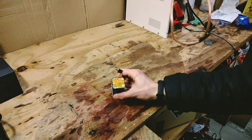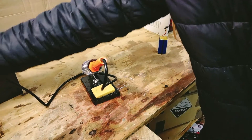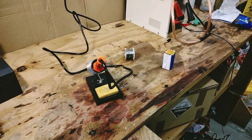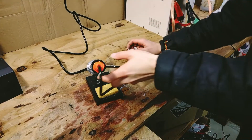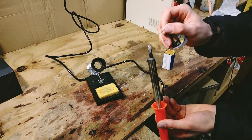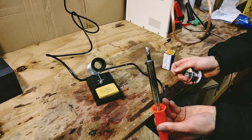I'm going to remove the BMS. To do so I've got a nice big soldering iron that I'm going to plug in and heat up. We'll be back in five minutes. So the iron's been heating up for a couple minutes — a little tip: if you get some solder and place it on the end of the iron, when it starts melting you know the iron's hot enough.